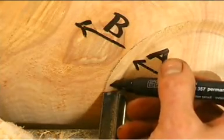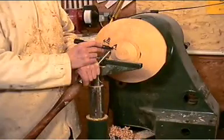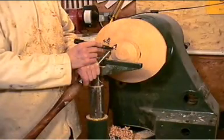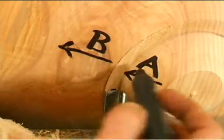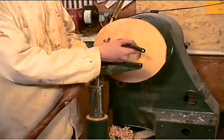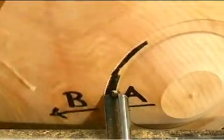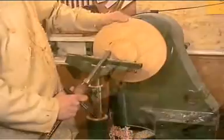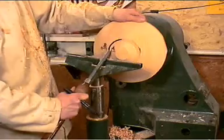See here how the cut actually takes place, not on the flat of the bowl surface, but in front of the gouge. Surface A here has already been cut. Surface B here is about to be cut. This wall in front of the tool is where the cut is actually happening. Each time the bowl goes round once, this surface is recut, recreated. The old surface is peeled away and the new one appears.